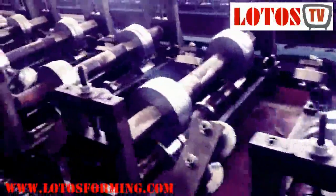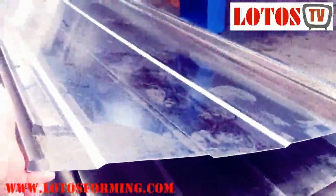Looking at this machine: one motor, side rollers, shaft rollers. For the multi-size question — if they need different widths, they can take this spacer bush out and put it outside to make different leg sizes. Let me show you the final profile for this machine so you realize it is for garage doors. You can check the thickness — the profile is heavy, and both sides have a double connection for the end gap.